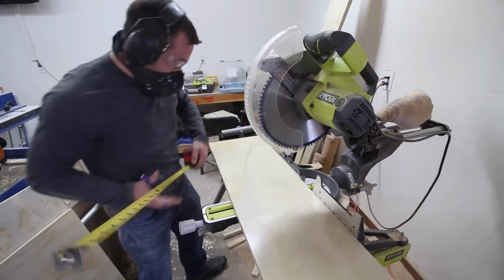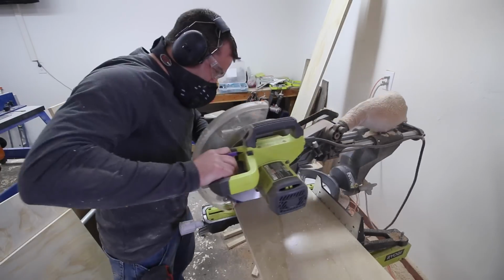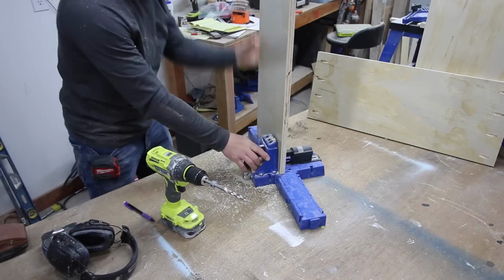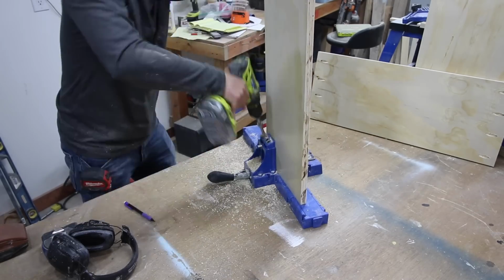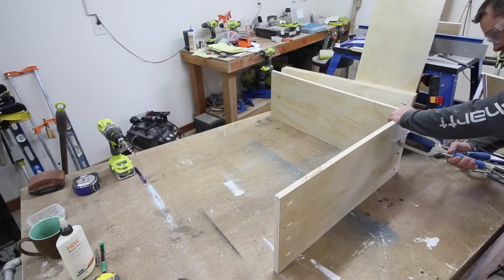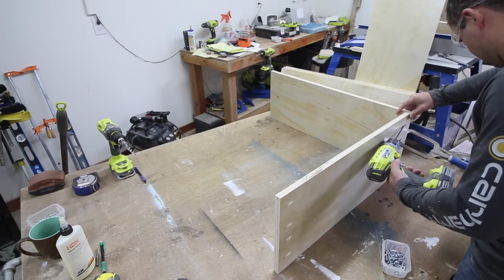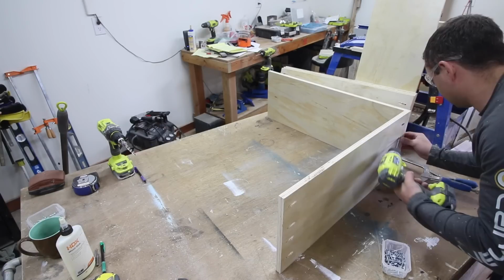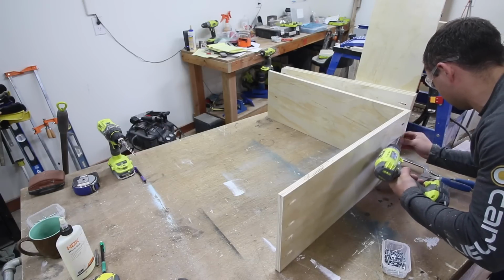The cabinet in this video is a pretty standard size and is 30 inches in width, but it can be modified pretty easily to best fit your space. The panels are connected using pocket holes, which makes the carcass go together rather quickly. Set a pocket hole jig for 3/4 inch stock and put 4 holes on the ends of each horizontal board. Use 1 1/4 inch long screws and wood glue to attach the boards to each other.